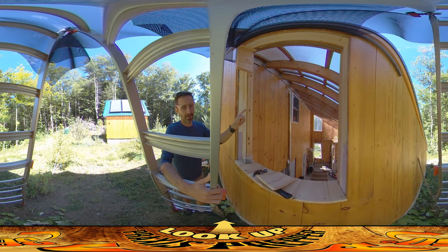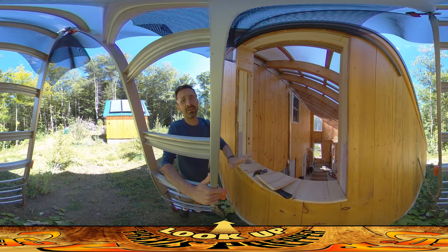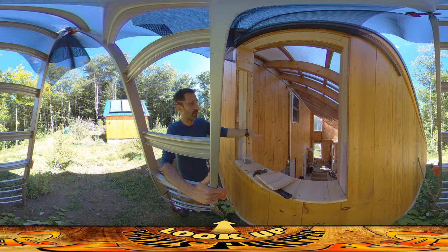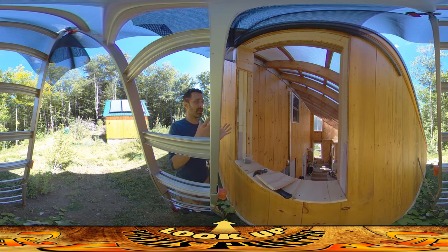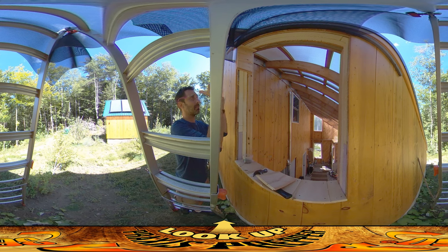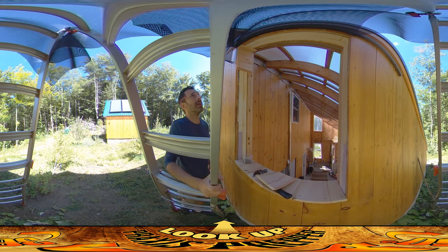Hey everybody, this is Praxis, and these greenhouses on both sides are much, much cooler now. The reason is I finally opened up these back vent windows. The bottom window has been able to open for a long time and let air in, but without air having any place to go, the place would just swelter. All this hot air rising to the top was putting pressure up there wanting to get out, but I had a tarp on here and it wouldn't let it out.